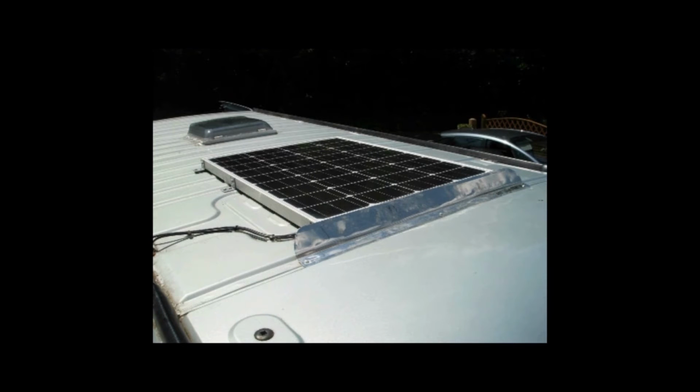And there's the cable going to the side of the van, where I've got bungs in the holes in the van which take the cable through. I just drilled some holes in those bungs, there you go, and I've secured the cable onto the roof with self-adhesive cable securing pads. Not quite sure how they'll fare, but we'll see.